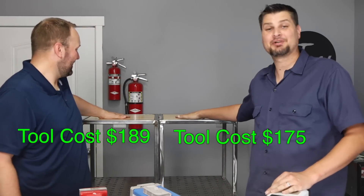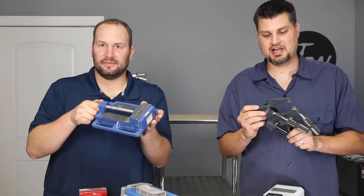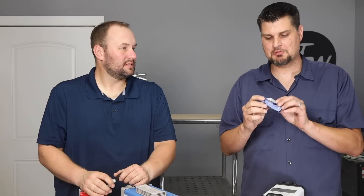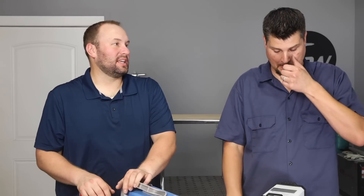We're back. Tim, did you build a table? I built the table! One big difference: I went with a vise-type clamp, where Jeff just went with $3.99 clamps. Something else that was different was how we marked our parts — I bought a couple of Sharpies off Amazon, while Jeff went with a straight-up razor blade, which not many people know about. A simple razor blade gets you a very fine, definite line. Jeff, what tools would you get next if you wanted to go beyond this basic $200 setup? He said he'd probably upgrade the welder based on duty cycle and extra features.